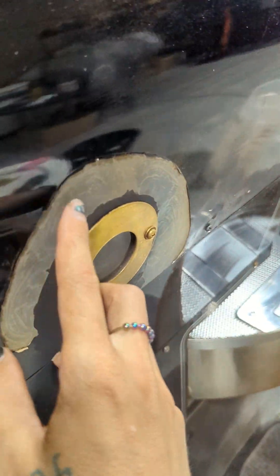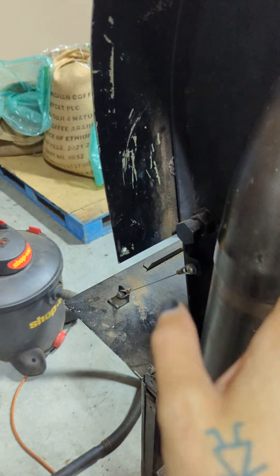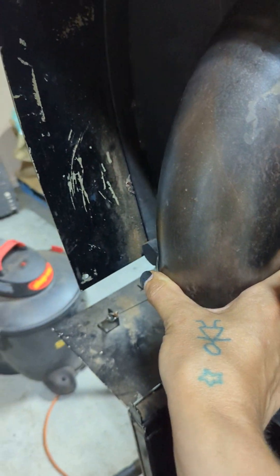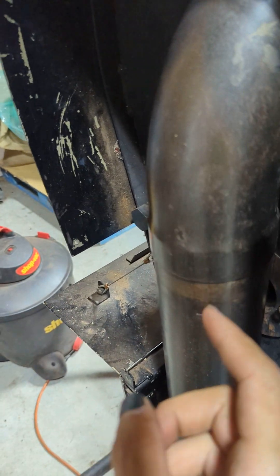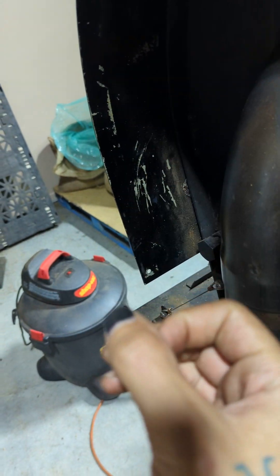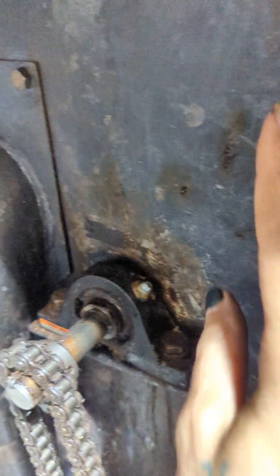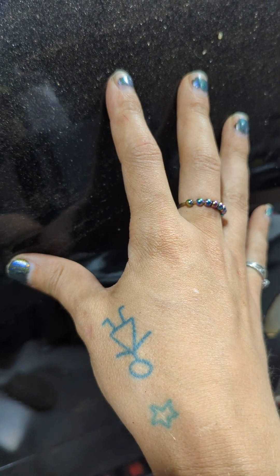That's all fine and good but as you can see right here, this is because it majorly overheated once. Here's that main exhaust port — I clean that at least every other time because I'm paranoid of this. Apparently they didn't clean it for like six months and it was barely open. What that caused was eventually it clogged up inside, nothing was actually exhausting, all the chaff stayed inside, it caught fire and boiled this thing up to like 700 or 800 degrees.